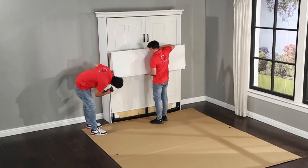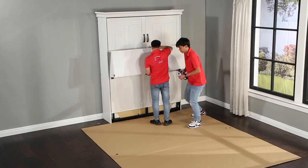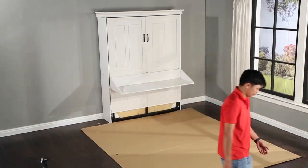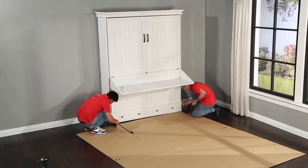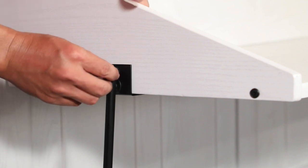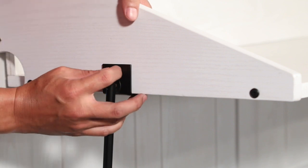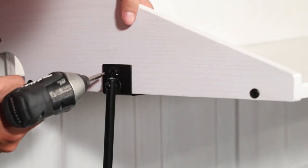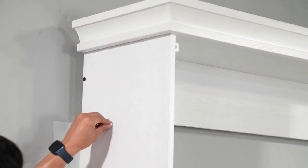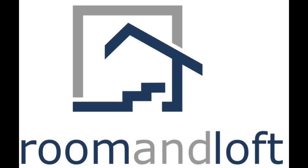While one person lifts the desk assembly into position against the bed tray, attach the desk to the bed tray using the k121b screws. Attach the end hinges before connecting the middle one. Now attach the kick plate hooks to the bed case sides and connect the pivot rods to the desktop using the k113a bolts and k128 binding barrels. Lastly, insert the wooden plugs into the holes on the side panels. That's all there is to it — we hope this video has been helpful to you, and we thank you for watching.